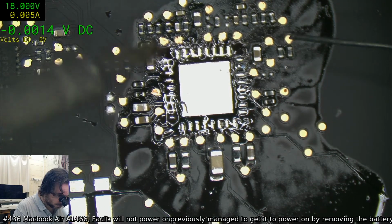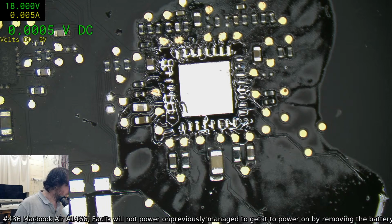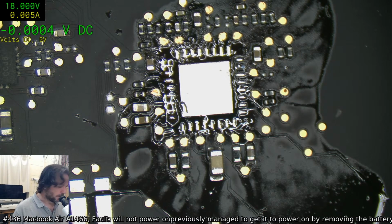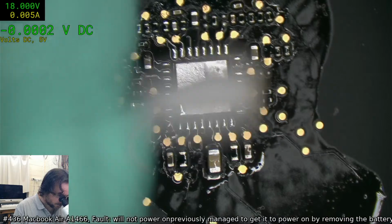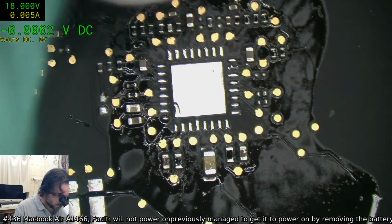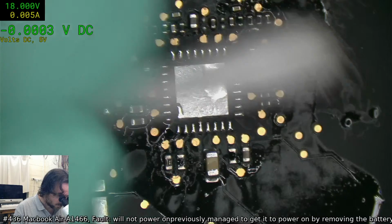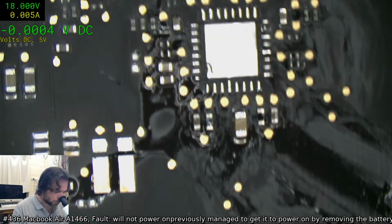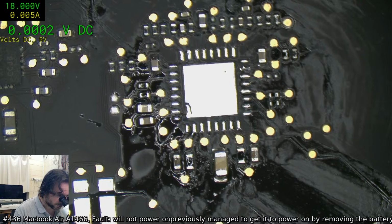There are a lot of Me Too capacitors on these boards. When you're designing circuits, you basically tend to do up whatever the data sheet recommends initially. Typically you farm around and you look for a chip that does the function as close as possible to what you're trying to do. And most of the time, your choice to use a particular chip can be attributed to whether they have an example or sample schematic setup that suits what you're trying to do. If you find something that matches, then you just cut paste that thing into your own project.